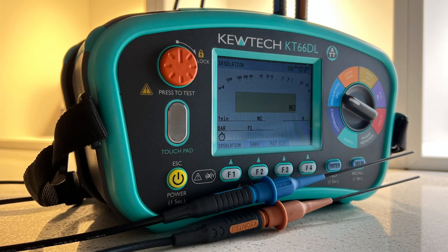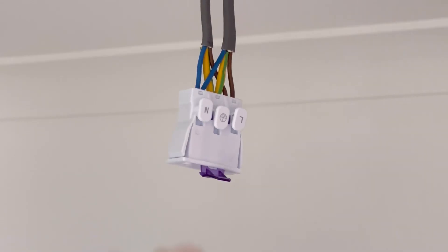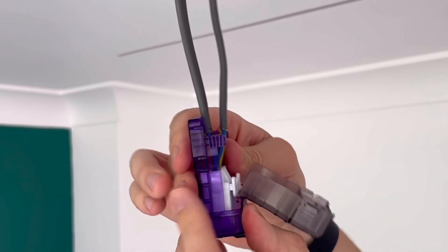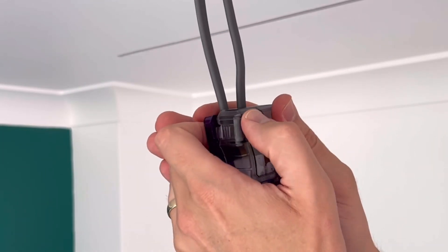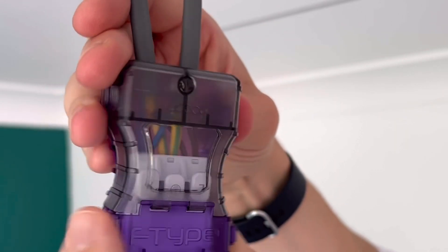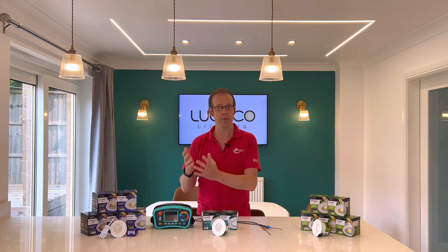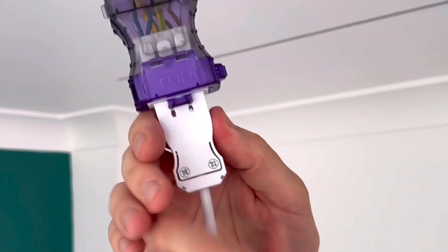Check out my dedicated video on insulation resistance testing of lighting circuits and the changes to BS7671 via the link in the description. Once you've made the connections into the terminal block, it just slides into the bottom of the outer enclosure and the bottom part of the lid snaps closed at the base. Then once you're happy that the outer sheath is correctly positioned, the grey lid hinges down and snaps closed, held securely by a single screw. And the grey lid also carries over one of my favourite features from the Essence and Mark II: a clear section where you can see that the connections have been securely and correctly made.